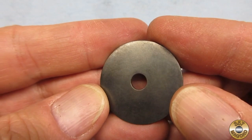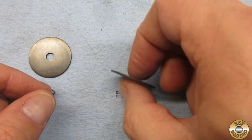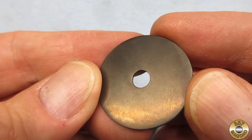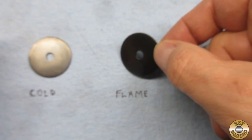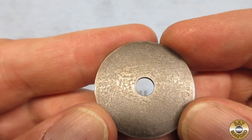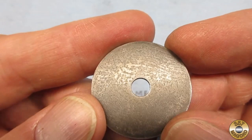Flame bluing is super easy and I've been able to achieve nice results. Because it requires heating the part above 500 degrees, it would not be a good method for heat treated steel parts. Rust bluing is fun — I feel like an old world alchemist making a brush-on rust potion and then magically turning it black. I've seen gunsmiths use this process to achieve amazing results on antique firearms, but I just don't think it's very practical for the type of projects I usually work on.